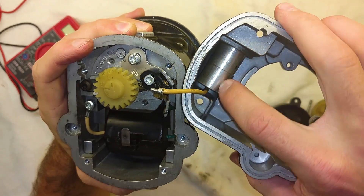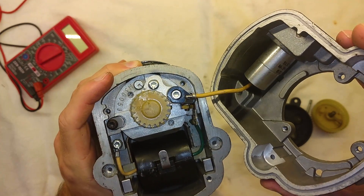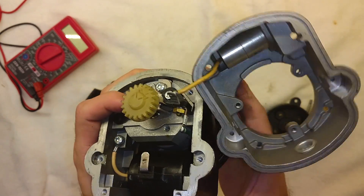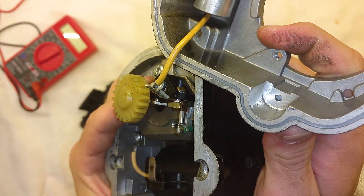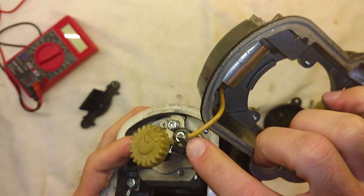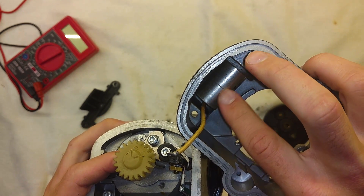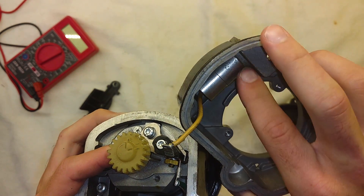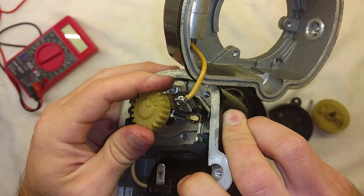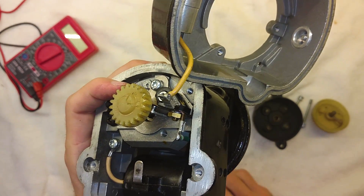Lastly in this assembly, we have this wire coming off here to our condenser — capacitor, condenser, kind of interchangeable terms. This could have been our problem; if that failed, then the magneto would fail. It would also generally give you some feedback through the radios, because when you open those points, the electricity built up in that coil wants to go somewhere. Normally it would just jump across the minute gap when it first opens, so we give it somewhere to go by feeding it to the condenser. Imagine the condenser like a tube and electricity like water — it fills up, and once full, it can't go anywhere else. By then the cam is at full deflection and the gap is fully open. When it closes again, we energize the other side and the process keeps repeating, generating lots of sparks each minute.